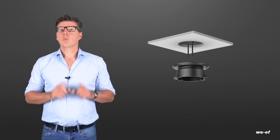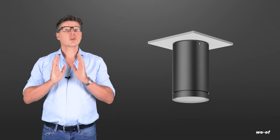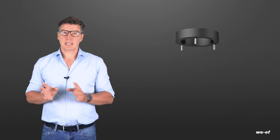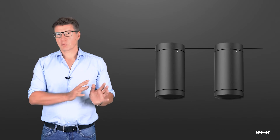Let's take a look at how they are installed. With their mounting flange, the surface mounted luminaires can be positioned directly on a ceiling outlet — the most elegant solution. An adapter, as an accessory, also enables cable entry from the side for very convenient through wiring. For example, to give existing buildings new lighting with very little installation work.